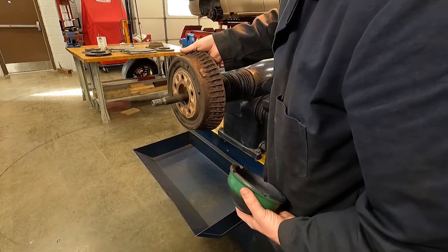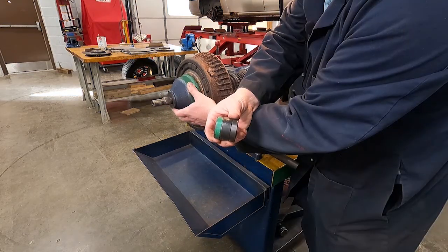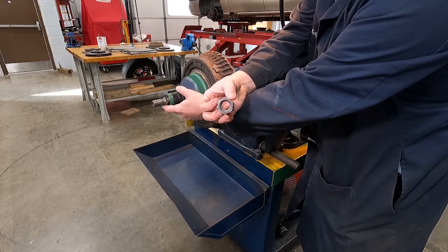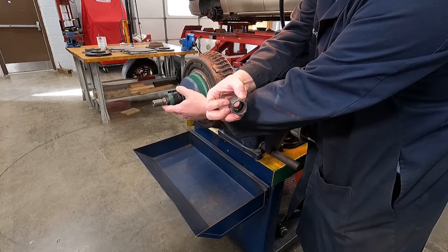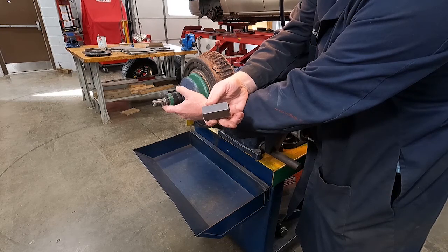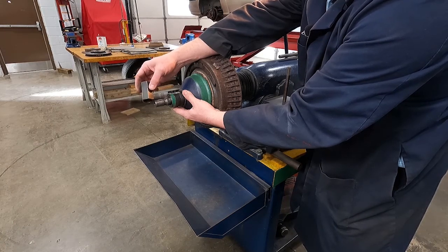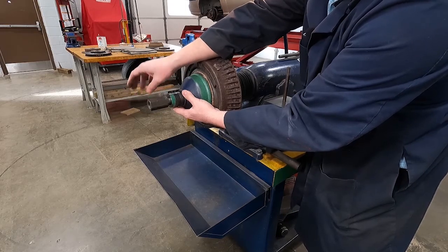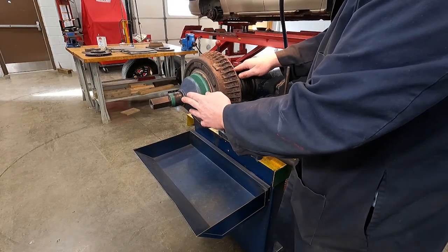Try not to just drop or slide it onto the arbor. Put the other cup on, then the spacer, then the nut. Now this nut is threaded out to the end on one side, but if you spin it around, it is not threaded — it's only threaded about a third of the way through. To thread the nut on, you'd bottom out on the arbor. But if you put the smooth, non-threaded side on first, it'll slide over the arbor and seat onto the spacer.